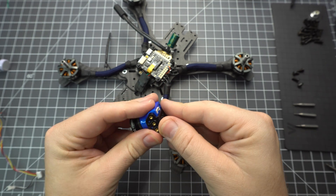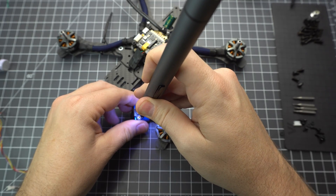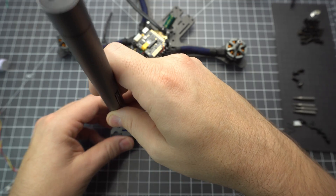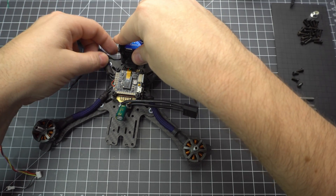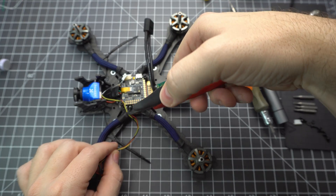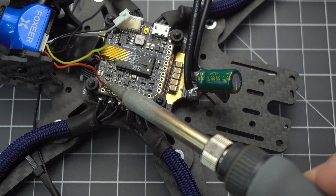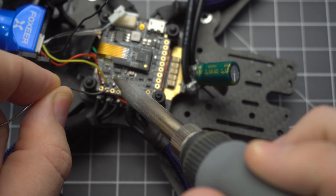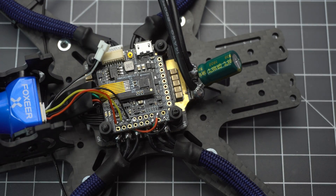Now let's mount the camera. You need to use this little bracket because this is a mini sized camera and this frame needs a full size camera. Just don't tighten these screws down too hard because I've cracked the plastic before. Mount the camera to the side plates but don't tighten all the way — you're going to need to work with them to make sure it fits the slots in the bottom and top of the frame. Also be careful not to pinch your antenna wires. You can remove the purple wire because we're not using the camera OSD — we'll use the OSD on the flight controller. Solder the three wires: 5 volt, video, and ground. For these kind of pads it works well just to add a little ball of solder and jab it with the wire. Make sure you've got solid joints and tuck those wires away — you're done with the camera.